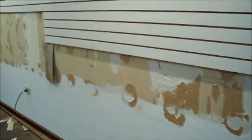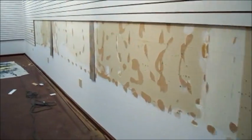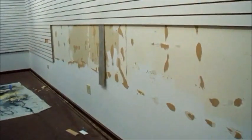And there's the screws. I had to pull out screws, so when I take the circular saw to it I can just yank that slat wall off. See, I have marks on the slats where I want to cut, so I don't cut in the wrong place on any of these. And there it is after I made the cuts. Ripped off the slat wall. It's kind of a pain. I mean, they really had it glued in there, and they had those tin strips along the seams, so I had to have the depth on the circular saw pretty precise so I didn't make sparks every time I hit one of those seams.